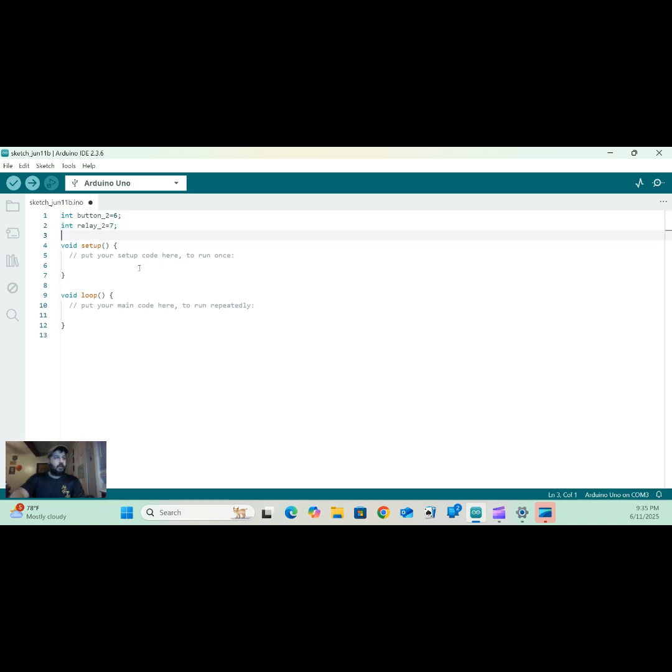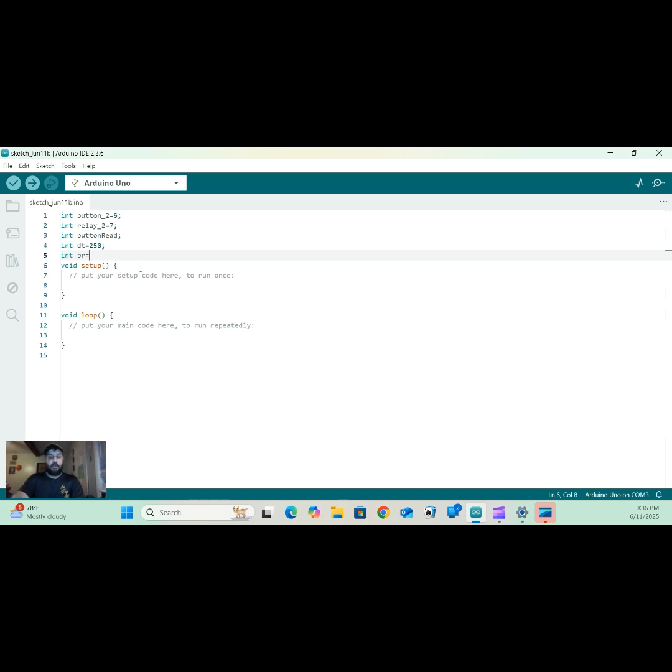Okay. Let's do another int. We're going to call this one button read. We're not going to add a value to this. We're just going to declare it. Let's do another int. Let's do a DT for delay time. Let's make that 1/4 of a second or 250 milliseconds. And finally, one more int, BR for baud rate, and let's make that the trusty 9600. With me so far? Cool.